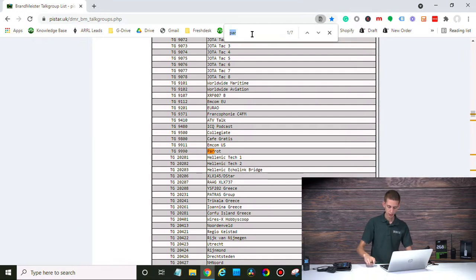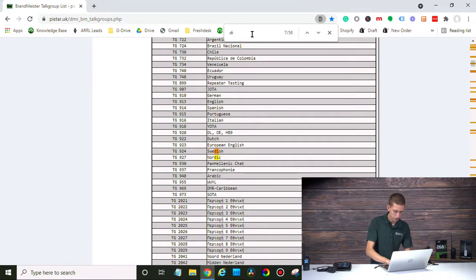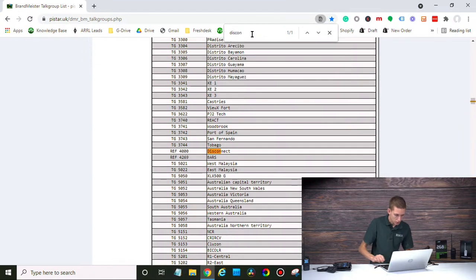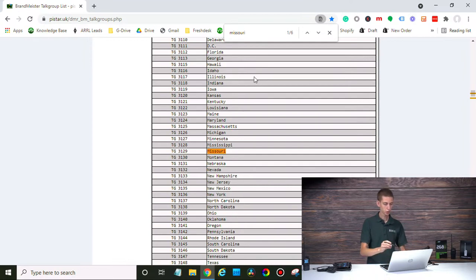And then how about the disconnect? Disconnect is always going to be talk group 4000. So let's go ahead and put that in here. There we go. Perfect. We have our disconnect. And then what else? Let's go ahead and throw in the Missouri talk group. Perfect. Let's see here. There's quite a few different. There we go. There's the standalone Missouri talk group. So 3129.